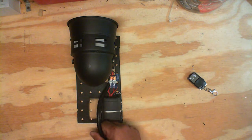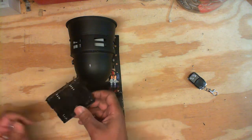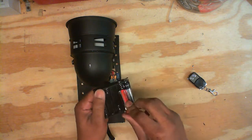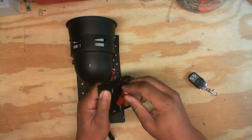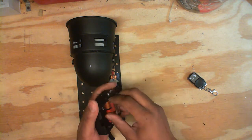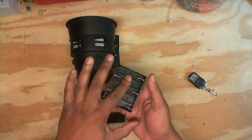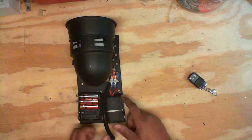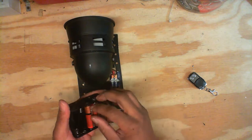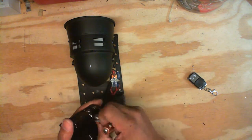And initially, I was powering this with a battery pack similar to this. And before a gig, I would just go get a bunch of double A's and add these up. I think this holds 10, 1.5 volts per each double A, just double-sided. Had it mounted here, had it wired in. It did okay, it's just that the siren pulls a lot of voltage, so these will run down pretty quick.